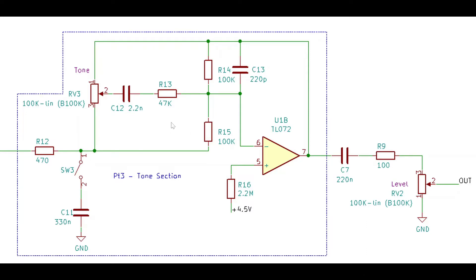I did try out several different versions and different options while I was preparing this. I added another filter here to just tame some higher frequency harmonics. I think I got the sound pretty close to Tube Screamer itself, with a bit more control using linear parts. I think I got it nearly 90% of the travel of the pot to sound really, really close, or even the same. We've been through pot differences and tolerance differences of different controls — I'm not going to go into that. You might feel it's slightly different. Again, this is why we do DIY things — to try different things and try our own takes on this. You'll hear a bit later how that sounds.